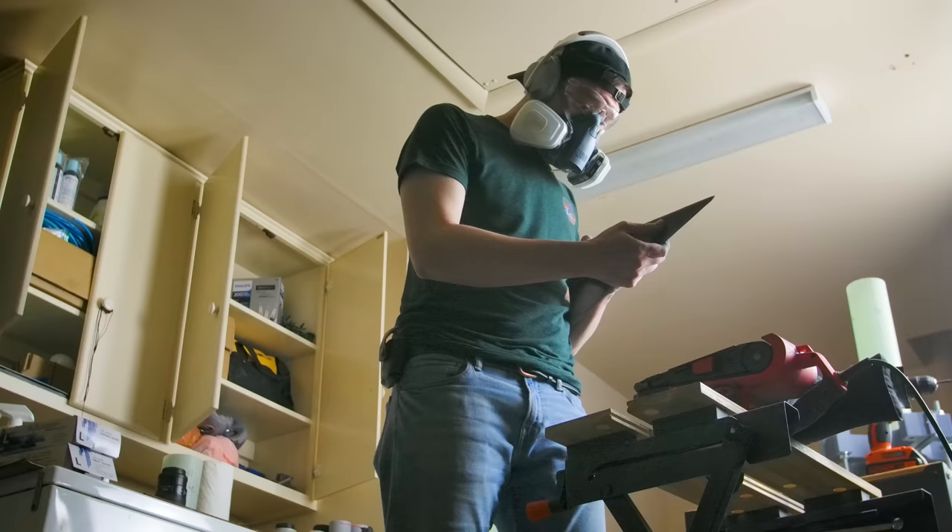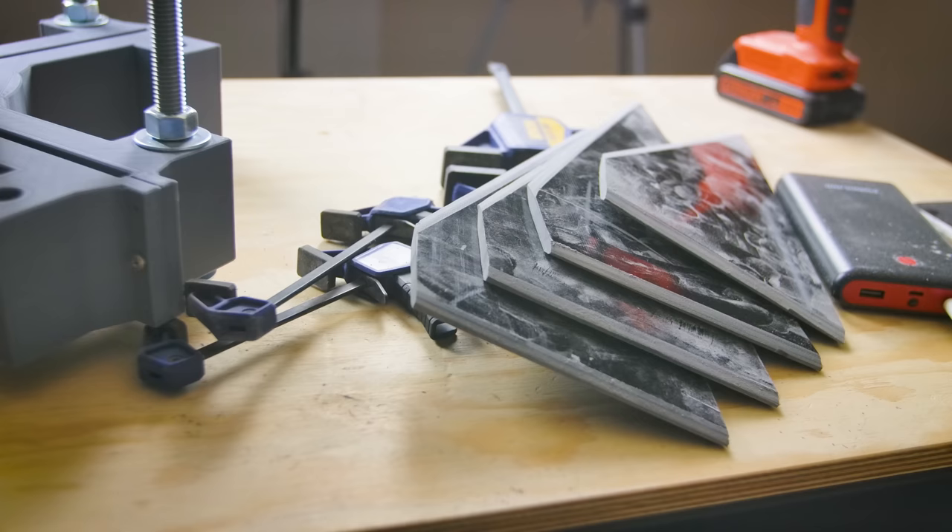We had plenty of stability margin, so even if I had to take off a centimeter in one direction or another, it was more important that the fins were identical in size to each other. With the shape cut out, I also needed to chamfer the leading and trailing edges. Honestly, I just got one fin to the point where it looked kind of right and based the other three fins off of it. Are there ways to properly size your chamfers? Yes. Will they make or break this flight? Absolutely not.